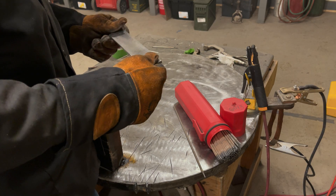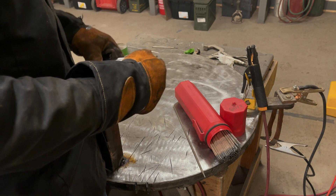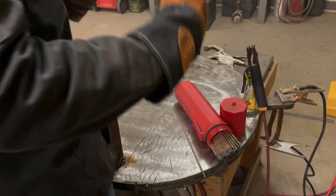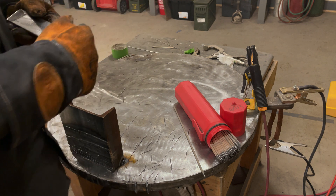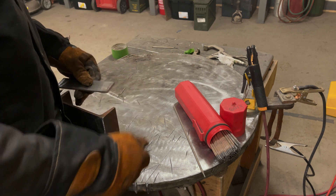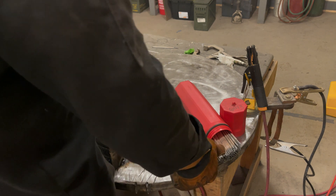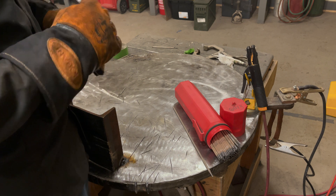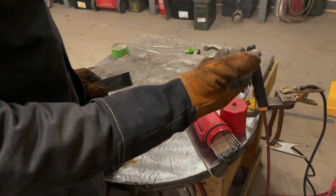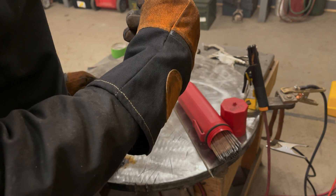Good morning YouTubers. On today's episode we are going to be doing stick welding in the horizontal position. My previous videos covered the flat position — haven't done any overhead or vertical up yet. We need to get up to that point, and this is a great place to start. For today's video we will be using 6013, and I know a lot of you aren't a big fan, but anyone with a stick welder — AC buzz box or high-end DC Miller machine — can weld with 6013 on any machine, any polarity.